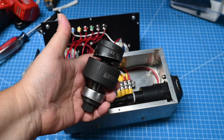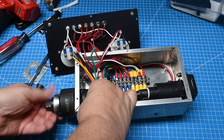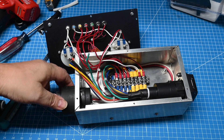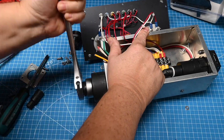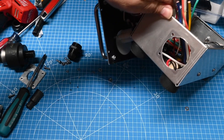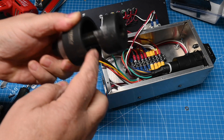The other option is a one and a half inch conduit punch. The one and a half inch conduit punch makes about a two inch hole, which is a perfect size. You thread this in, then tighten the punch with a wrench, and it cuts that hole. You can see there we have a perfect hole. This particular brand is nice because it cuts the pieces in two — otherwise they can be jammed in and be hard to get out.